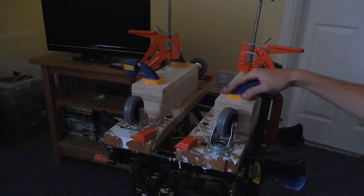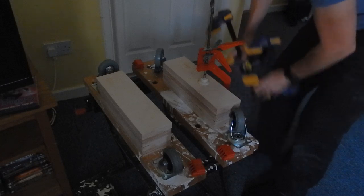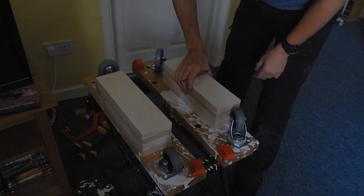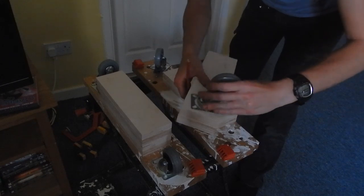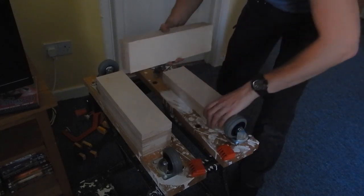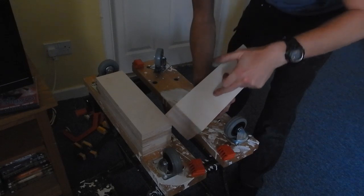Over here I've fabricated some large blocks of plywood for the caster feet for the mobile base. These are currently in two halves. The idea is that you've got some short bolts through the casters in here, and then I can screw these two halves together like so, then fix the whole thing through the base I showed you earlier.